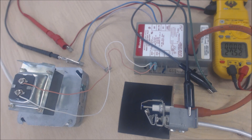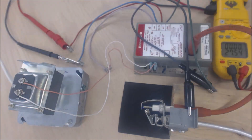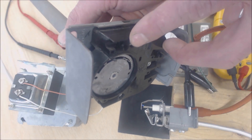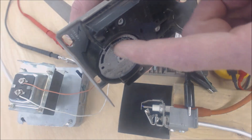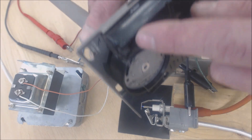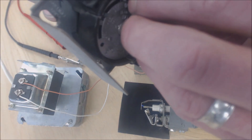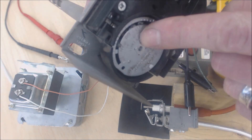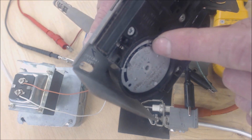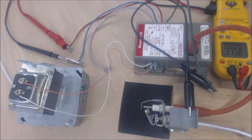You're also going to need another control — like a fan limit control — to turn the blower motor on and as a limit to prevent the furnace from overheating. This fan limit control has a limit on one side: if temperature gets up to the third knob setting it shuts off main power to the entire furnace. On the other side, the fan turns on at the second knob setting — typically around 120 degrees — and shuts off at 90 degrees. While I was explaining that, the spark shut off.